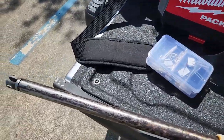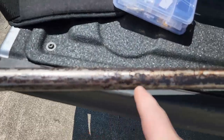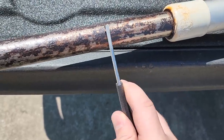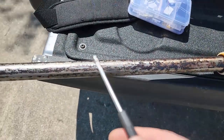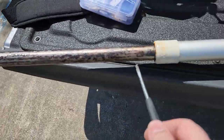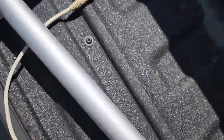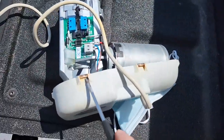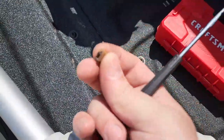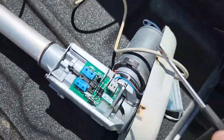I'm going to get my screwdriver here. One of the things I want you guys to realize is this linear actuator does have some pitting. It's nice and shiny now because I cleaned off a lot of the pitting and put a layer of grease on there — the grease also helps loosen up the rust. These linear actuators have clips that go around the perimeter of the shell; all you've got to do is pop these clips off with a little flat blade screwdriver and you can get into the guts.